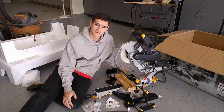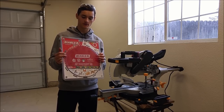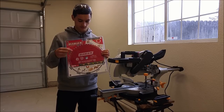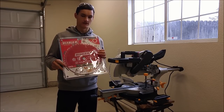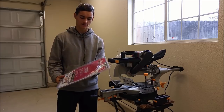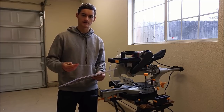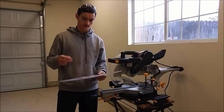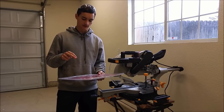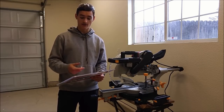I'm back and it is the next day. I did manage to find a saw blade at Home Depot. Diablo was the only brand they carried in a 12-inch blade with a one-inch arbor, which is what this saw takes. It has 44 teeth and it's made for general purpose use. A 44-tooth count is kind of low, which means it's going to cut a little bit faster but the cut won't be quite as smooth as a higher tooth count. It is a general purpose blade made for miter and sliding miter saws, with the capability of cutting pressure treated lumber — all of which I was looking for.